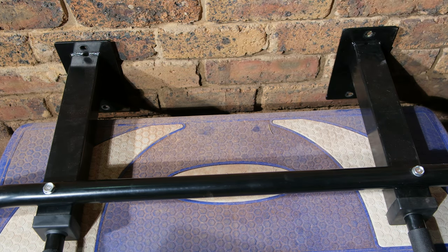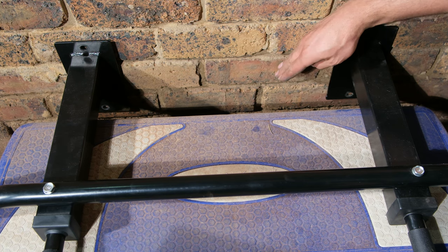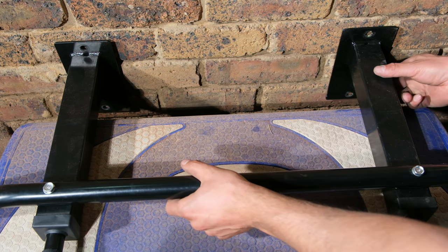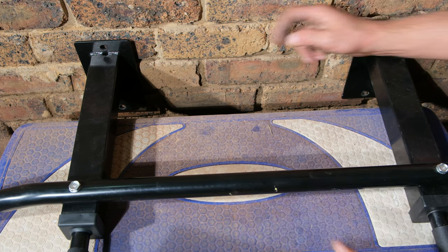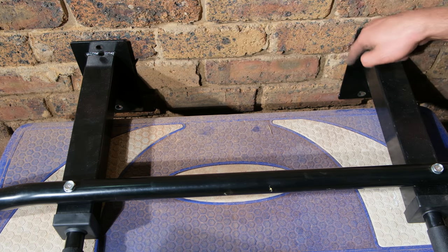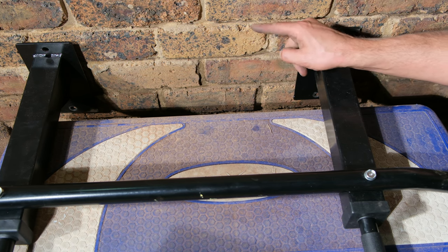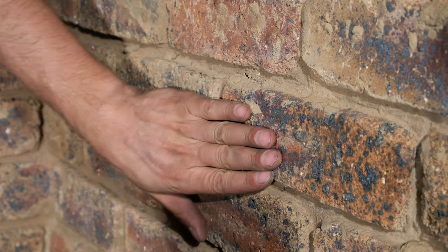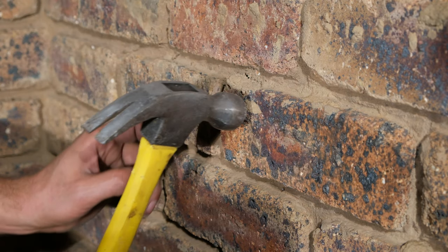I also need to have a spirit level on the sides to make sure that the sides are not warping in or out. Now I'm using a face brick wall which allows me to see the bricks. On this side I'm going in a brick and on this side I'm going in a brick — what I don't want is to be in a brick on one side and just in the mortar on the other. Ideally I want brick and brick on all four holes. Also try not to get it right on the edge of a brick — it's quite difficult to drill and the brick splits and doesn't hold very well with the expansion bolt. Some face brick has rough parts and if you put the bracket flush on the brick you might find it's standing off because of cement or brick particles. You can just take a hammer and hammer them away.